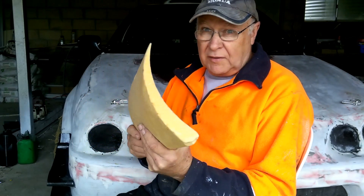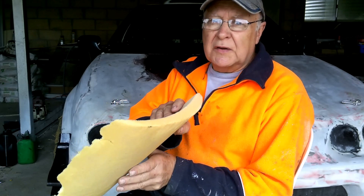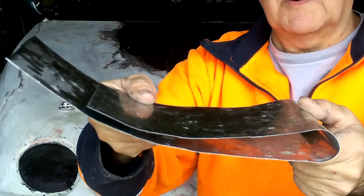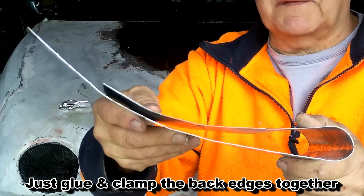But what do you do if you haven't got one of those? Well, you can make a copy of this yourself — a similar sort of thing — using sheet metal. It's fairly easy to bend sheet aluminium around a steel tube and make your own metal die. But use the lightest, thinnest aluminium you can find.